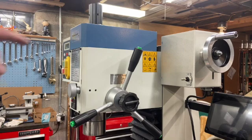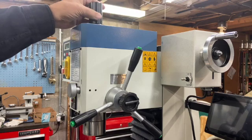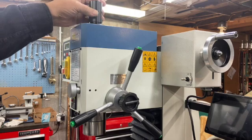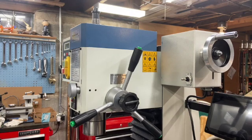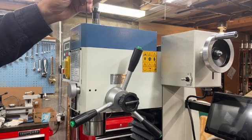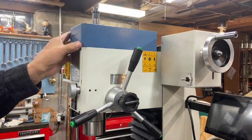Right here up on top is the cover to the motor belt that goes between the motor and the spindle. To take it apart, first I suggest you take off this piece because it's really heavy, and the box that covers the belt is made out of cast iron so it's also heavy. You need a three millimeter Allen head — these are quite deep screws — four screws, and then this lifts off.